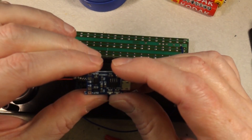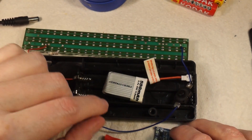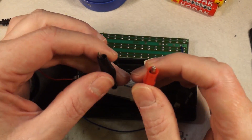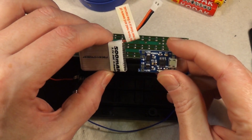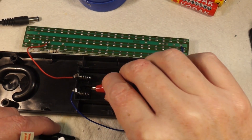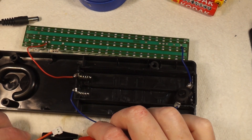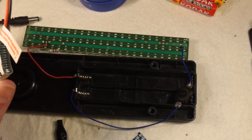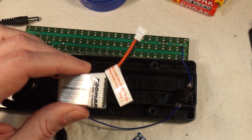I've got one of these 5-volt USB charging circuits — you've seen me use these before — plus the battery and a couple of bulldog clips. It's not ideal but I just want to do this temporarily to see how it works. I'm going to connect the battery to the charging circuit, then have a couple of wires going to bulldog clips and clip those onto the battery terminals inside the torch. That way we can see how long this battery lasts and whether this is feasible as a way of powering the torch.